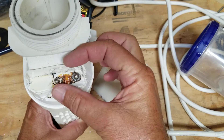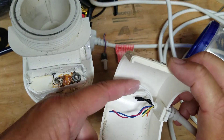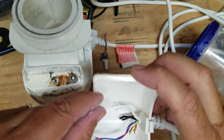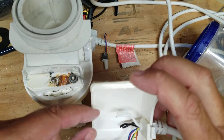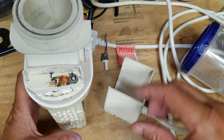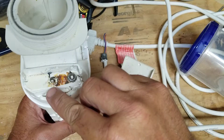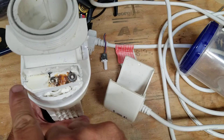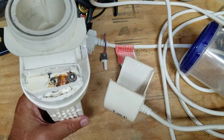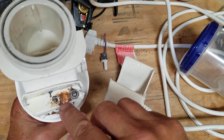This little well right here is where you put your wires. You get the two white wires, put a connector on them where they're joined together — a speed-type connector. Same thing on the other side: white goes there, black goes there. They tighten them down, and with the device sitting like this, they fill in the well with epoxy to try to waterproof it.